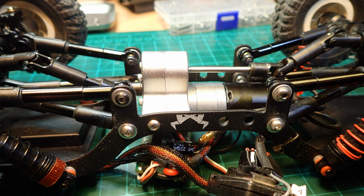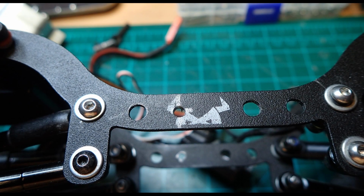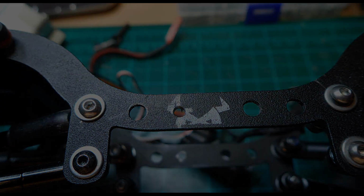There's only one hole in the frame in the front, but anyway those holes are too large. But I tried to mount it in the other direction with the motor to the back and the gearbox to the front, and I think this is probably the better way. So I made a further 3mm hole for the M3 screws for the gearbox, and the front hole is too large now, it's 4.5 mil.